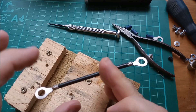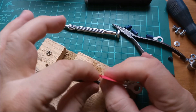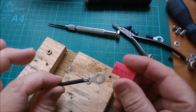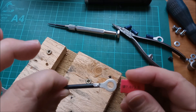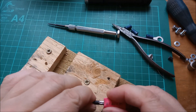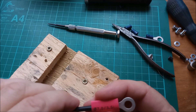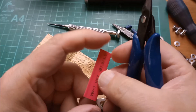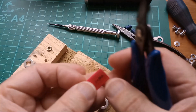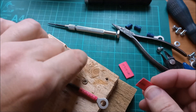Then the heat shrink — I didn't want to put heat shrink on this wire before soldering the ring terminal, because it all gets extremely hot and it would pre-shrink. So I needed to find a piece — this 7mm is about right — that fits over the end of the ring terminal. It is a bit of a tight fit, but I can push that on there and push it past the ring terminal ready to be heat shrunk. These are from one of those little sets of heat shrink with pre-cut lengths — I'm just cutting them in half because that's about right.